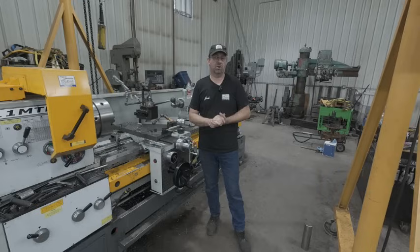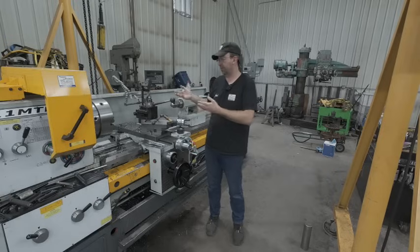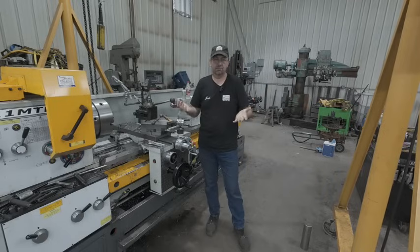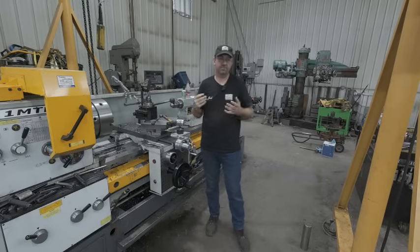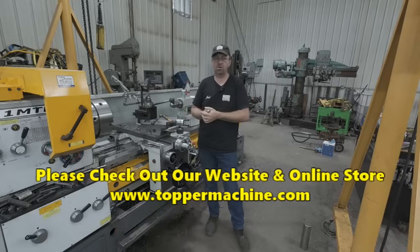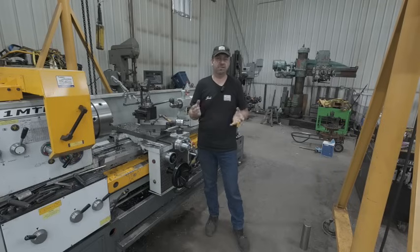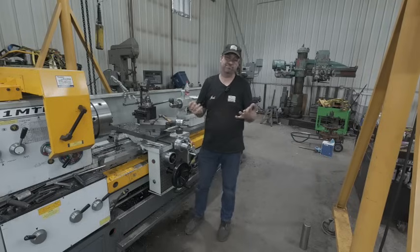I hope you enjoyed the video and I answered all your questions. There were a lot of really good questions, mostly about why I ran in reverse — just because that's the direction the boring bar was set up for inside turning; flip it upside down and now it's for outside, but it's upside down. I probably will be on the lookout for another two-inch boring bar in the other direction just for this exact purpose, since I do have one other job where I run in reverse and I've never liked the finish I get. It's only about twice a year, and it's cast iron, so it's not a big deal.